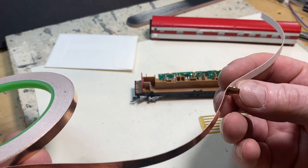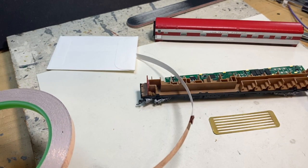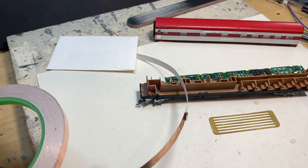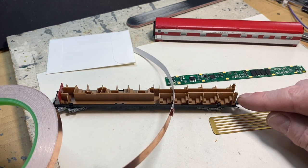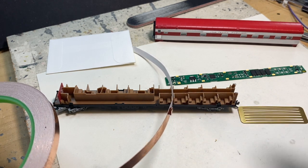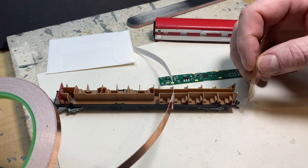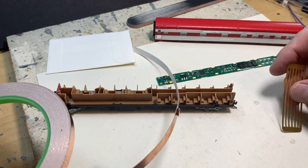To make all of that work, we're going to use copper tape. It's very thin, conductive, and we're going to fasten the brass strip to here. There's no mechanical tension on this — it just has to hold the two pieces together. It's very sticky and very conductive, and it'll work perfectly. The one millimeter strip will fit right there and we'll just bend it around.